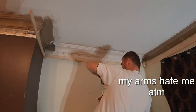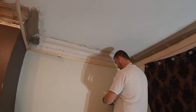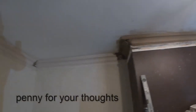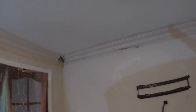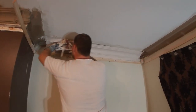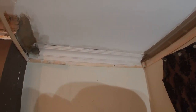The stilts don't give quite as much power but I didn't want to be putting trestles around the whole room, so the stilts sped me up a lot for this plastering part of the job. Let me know if this is a type of plastering you want to see more of. You'll notice big holes in the corners — the reason is the running mold doesn't fit in there because it's square. So unfortunately you will have to do the corners freehand, rule them off with a joint rule.